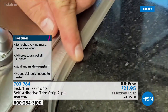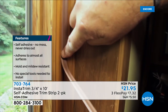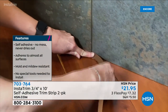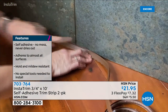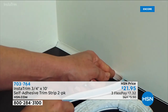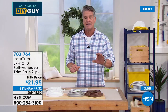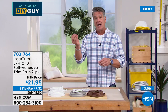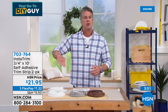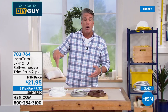When you seal it, you're making the toilet more sanitary. What if you've got a door jamb with cold air coming in, or around a window or screen door? Wherever you've got two surfaces, you can use it. Here's a tip: before applying, take rubbing alcohol on a paper towel and wipe the area. Make sure there's no moisture, and the rubbing alcohol will get rid of anything nasty. Let it dry, then run the InstaTrim around in that oval path.